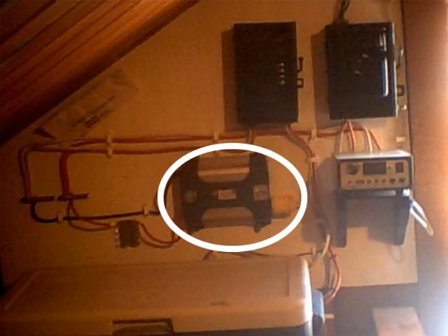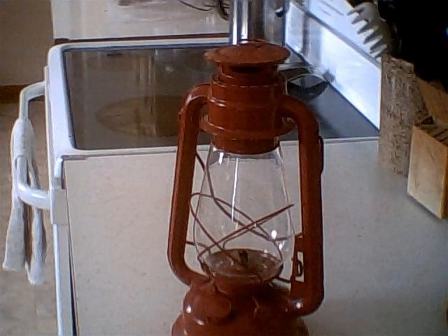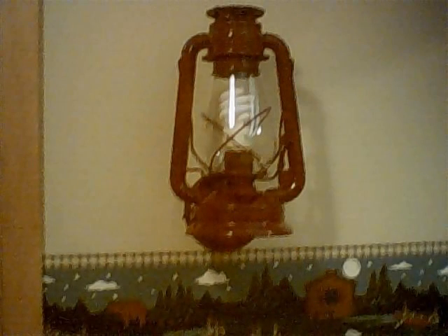My junction bars are connected through a fuse block to the inverter — it's a 750-watt modified sine wave inverter, good enough to do what I need. From the inverter I simply wired a plug and then went to house wiring from there. The wires are fished all the way to the basement, and from there distributed with regular house wiring to an outlet in almost every room of the house. We wanted a wall sconce in the bathroom but couldn't find one that matched our decor at a decent price, so I bought an oil lamp at Walmart for six bucks and made my own lamp out of it with some scrap parts.